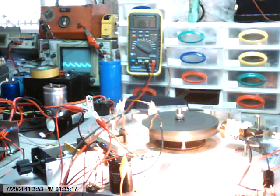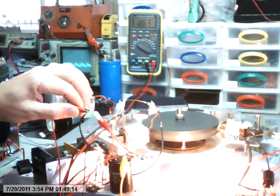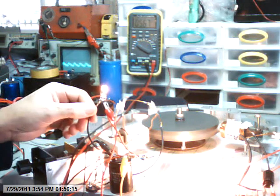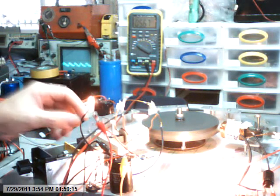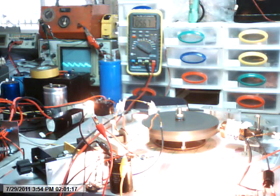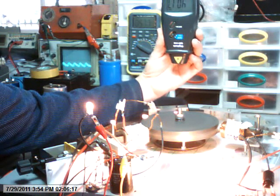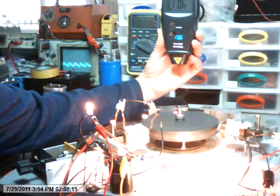Let's check that — 1.86 volts, so it's only 300 milliamps. The motor is going 300 milliamps through the resistor. Now it's drawing 200 milliamps through that resistor and in series with the globe. As you can see, this is now illuminated. As it illuminated, you should have seen the voltage on the multimeter jump back to 5.6 volts, and RPM has topped out at 4,024 RPM.